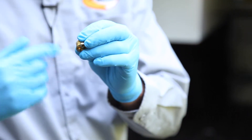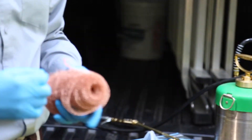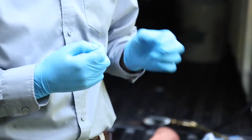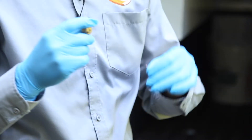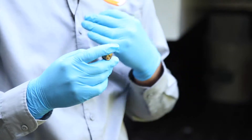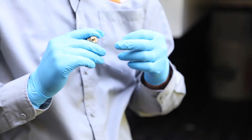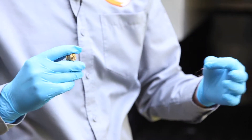From the back side you can see how it funnels in toward the end. What you would do is run some water through there to loosen it up. I find success taking a piece of copper mesh — like a needle — and threading it through one of the openings, working it back and forth. That usually cleans it up. Keep in mind this is brass, so if you do that too many times the spray pattern will be affected.